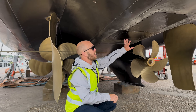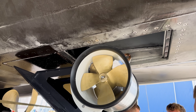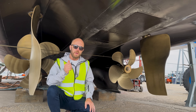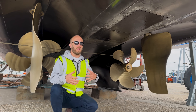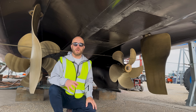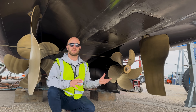As mentioned earlier, we've got the swing-down stern thruster here — a thruster of the same size as the bow thruster, so 50 horsepower. When that swings down, the Praxis system has a position-holding capability. At the press of a button the boat will hold its own position — we call it a virtual anchor. Whether you're in a sensitive area where you can't drop your anchor, or you're just looking to hold position for a short period without going through the process of anchoring or in deep water, that's a really nice feature that comes with the Praxis hybrid system.